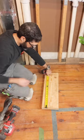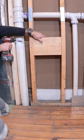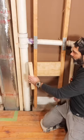The reason why I'm doing this is so that somebody doesn't ruin the drywall when they go for a toilet paper run. I used 3-inch screws to secure the blocking, and I extended that out using a 2x4 because after all, we've got both a toilet paper holder and a remote.